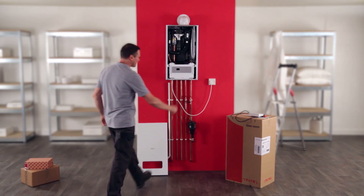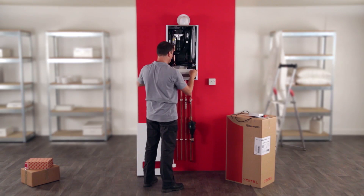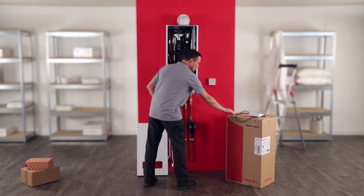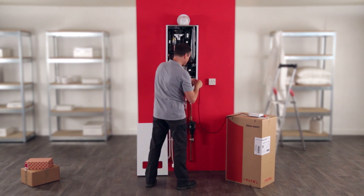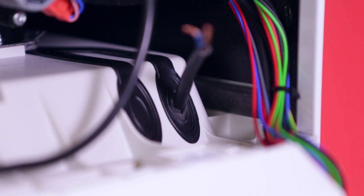As a first step, you need to isolate the boiler from the 230V supply. Open the eBox cover and carefully lower it. Pass the room thermostat wire through the selected rubber grommet and wire to the white eBus terminal.